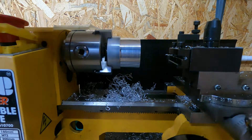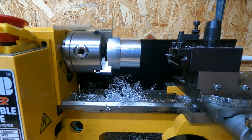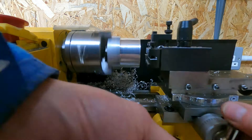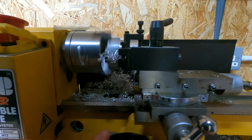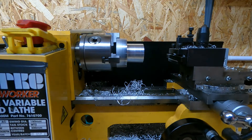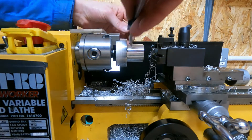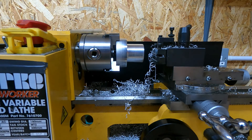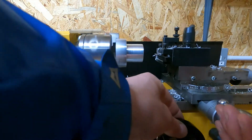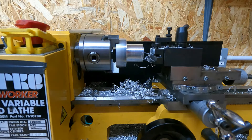I've made some progress — now down to 57mm from 63mm, so I've taken 6mm off the diameter. It's quite slow going. We're now getting close to our 40mm. We're at 40.6mm... about 40.1mm. I think that will do for now.